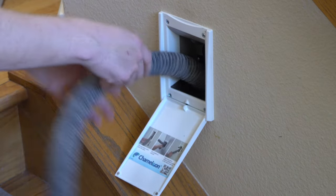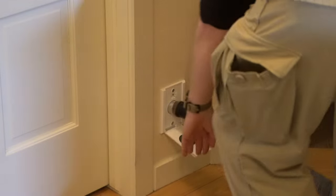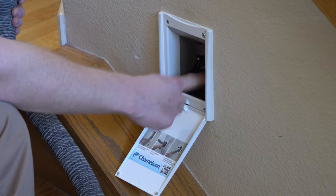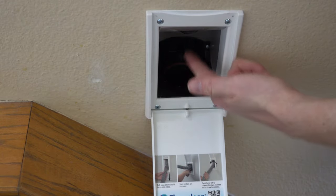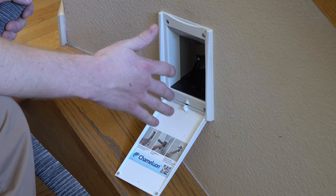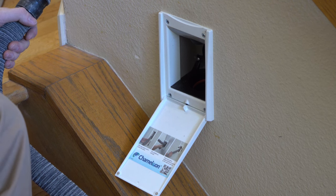The other thing going on here is that this can be given a half twist. You can pull this out of the wall and plug this directly into any traditional central vacuum outlet around your house. This is an optional feature that you can have installed, and it's called a cam port, which means there's an additional door in here — like a toilet seat door — that you can close up. That way when the system's on it's not leaking there, and you can go plug this in somewhere else. And unlike some of the other systems, it's not reliant on the door to make a seal — it's reliant on a gasket in here, which I think is a really, really good addition.